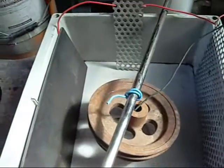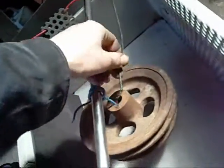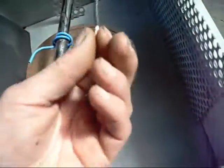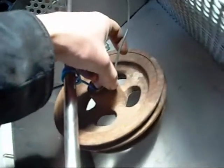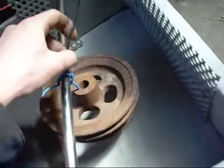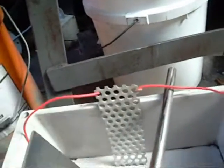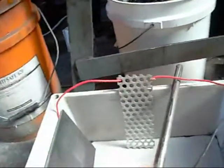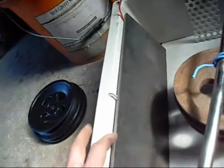This tank is set up to run — if there were electrolyte in there it would probably work, although I have run out of alligator clips. You obviously have to connect your negative lead to the work piece. It is worth going out and buying some half inch alligator clips so you can clamp it on and make positive contact with the metal. That is always your negative lead — if you get the two mixed up you will start eating your work piece away, and that is not fun. Make better connections than these on the sacrificial anodes — preferably grind the coating back and solder them on hard, although ring terminals will do for the time being, though the connections do break down over time.